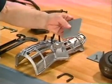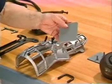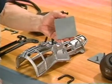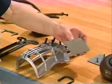Part of our maintenance would have us looking at the spotting cup liners. There are 3 of these liners in each cup. They help keep the pins clean, reduce the noise that would occur as the pins drop into the cups. These need to be clean, cannot be sticky, cannot be gummy, or the pins do not slide well.